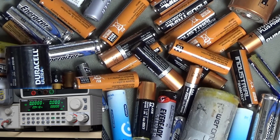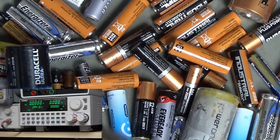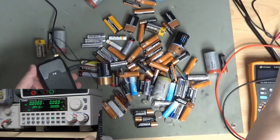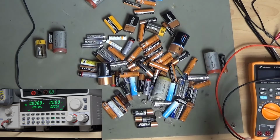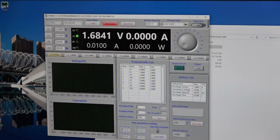Which, let's say for example, your battery meter in your camera or whatever is calibrated for alkaline batteries, which have a more gradual discharge, then it will be fooled into thinking that you're fully charged. And one of the things that was happening with my microphone was that it would show full charge, and then in the middle of a recording just cut out because the battery was dead. So yeah, there's a different characteristic for a lithium battery, but we'll see that as we test it.